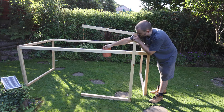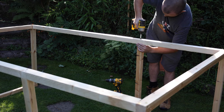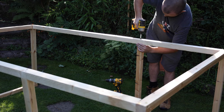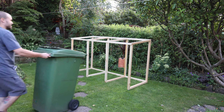The two outer frames will be joined with long pieces of timber along the bottom, the back, and the top at the back. I've got two screws joining it at the bottom and one screw at the front for now. For the cross piece, I've gone for two meters five centimeters — that should give me a 65-centimeter opening for each of the three bins and allow for roughly five-centimeter-wide partitions in between. I'll pre-drill a couple of holes for the top cross section to avoid existing screws.